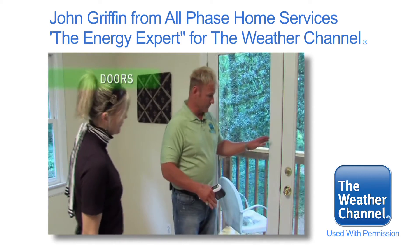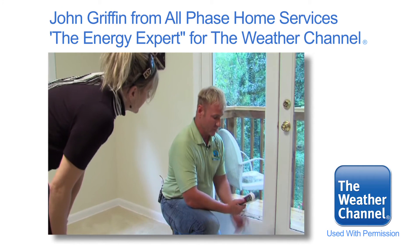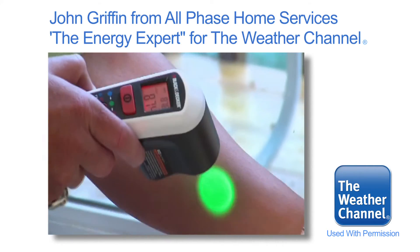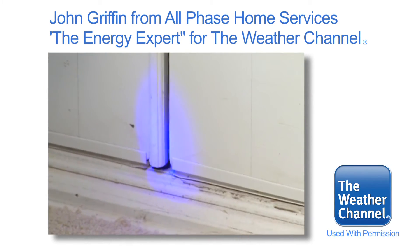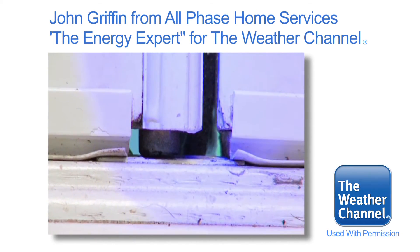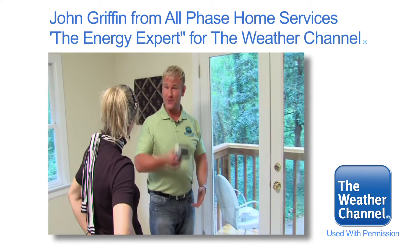This door looks like a little bit of an older door — you can actually see daylight coming through it. This is a handy-dandy leak detector that works off of thermal energy. When we turn it on, you can see one color on my arm, and as soon as we come over to the door it changes colors because it detects the leak coming through. You can put a door insulation kit on this thing, wrap it up, cut out that draft, and make it more comfortable sitting here watching TV.